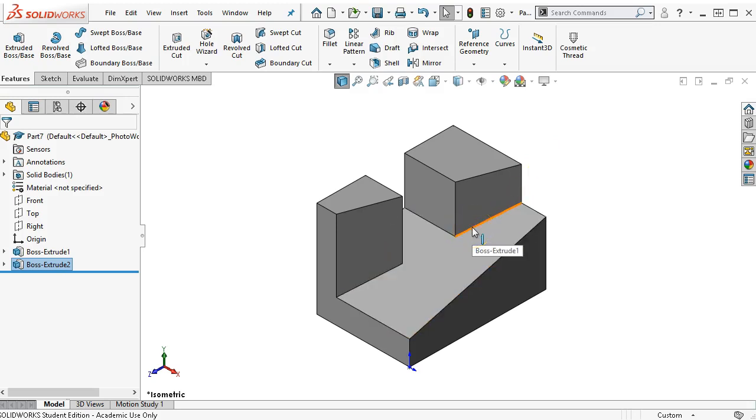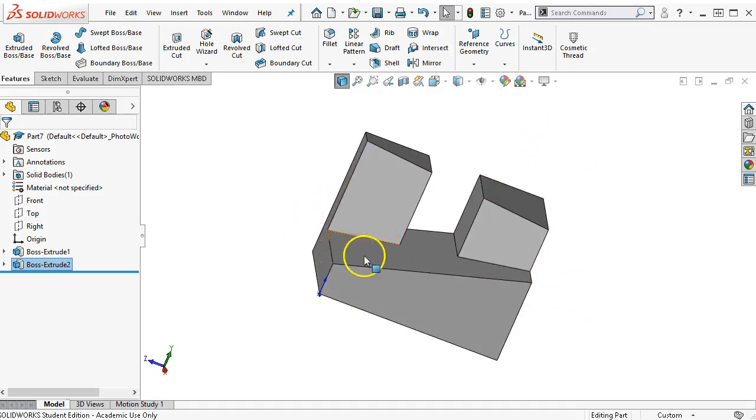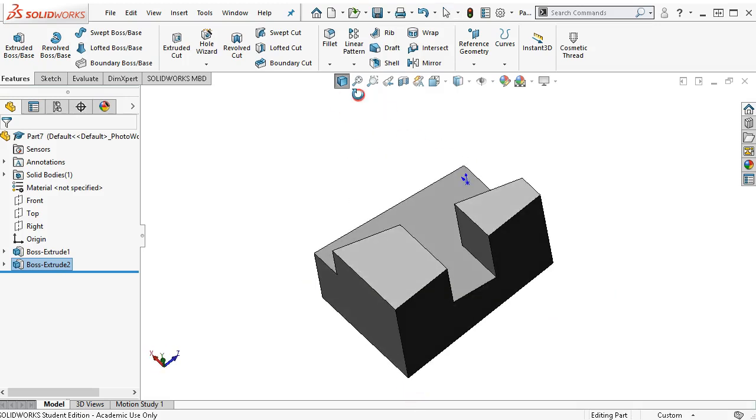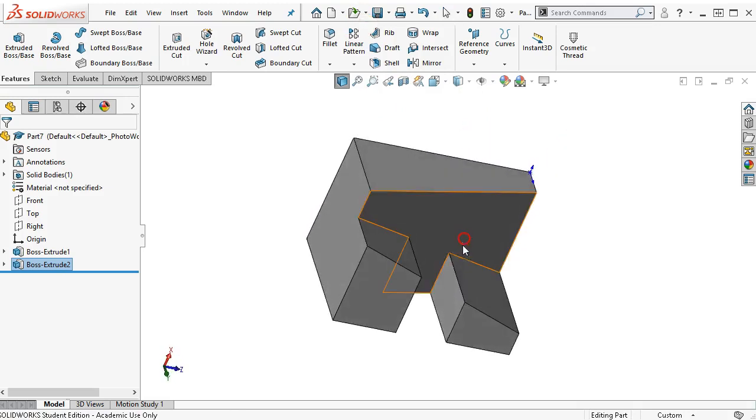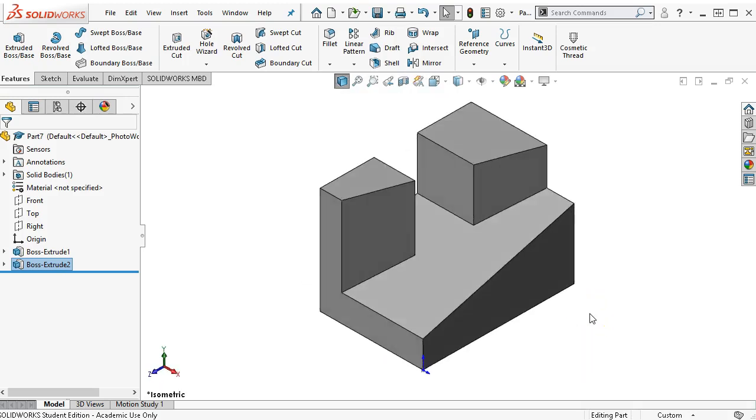The issue is still with these corners — I'm either going to have to blend. With the remaining sharp corners, if I go to this angle I could get an end mill to run back and forth. But the notch and this geometry mean I'm going to have to set up on a wire EDM to come in, and then it's a blend issue coming across this face depending on how accurate my touch-off is. I can't do that in just one setup. If I can include some radii I still have a blend issue, but I might be able to get it if it really needs to be a consistent surface, depending on surface roughness. So that completes the exercise, but I wanted to show a surface approach.